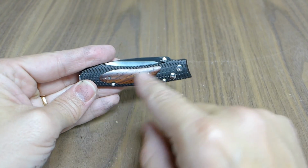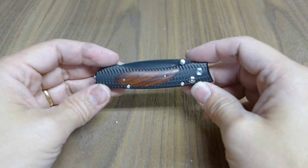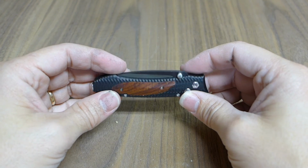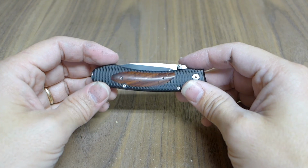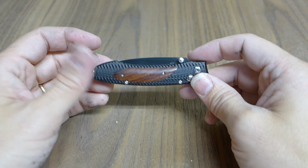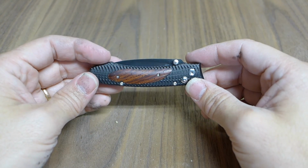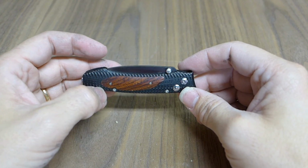This one has a Cocobolo inlay, and as a woodworker I can tell you that Cocobolo is nice, but it's not super nice. It's not like mahogany, which would not make a good inlay because it's too soft, or lignum vitae, which would certainly make a good inlay, but it's impossible to machine, or bloodwood, or purple heart. The Nundy I have has snakewood, which is extremely expensive by the board foot. Cocobolo is sort of a tier down from the super crazy woods. Maybe it's in the same tier as purple heart, but it's well done here.